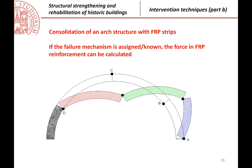So, for example, if I'm considering forces, the forces can be distributed forces due to the weight, for example, but also horizontal forces now, because they are the forces related to the earthquake, for example. I don't know where are the possible positions for the hinges. I have to consider all the possibilities, and the one which is true will be that related with the lower action. Also from a physical point of view, this makes sense, because all those mechanisms are possible if you think that it is like to have forces that from zero are increasing. Then when you reach a level where a mechanism is formed, then you have failure. Okay, so this is the principle.